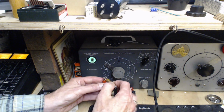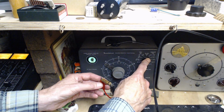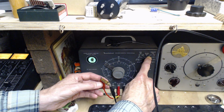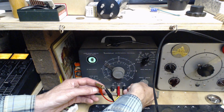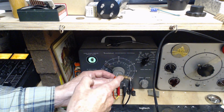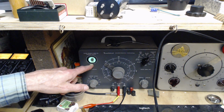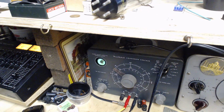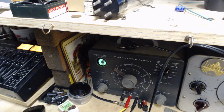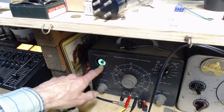And the way this works is pretty simple. I'm going to set this to a certain voltage. Here it says 25, but it's actually 50 if you measure it. 50 volts. When I rotate this control, it will apply the 50 volts on here. This is basically a current meter. See if I can make it a little more visible. It's a magic eye with an open pie. I just put my shadow there. You can see the opening is down below, and it's open wide right now.